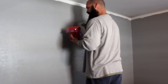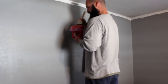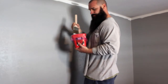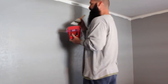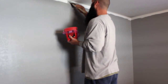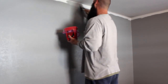And they're all like eight cents a piece. So what I'm doing is loading up the middle of the brush — I'll dip it a couple times, squeeze out the sides. Loading up the middle, that's where you want to paint from, so you don't get big beads of paint. Now I can just follow my caulk line instead of the highs and lows of the texture.